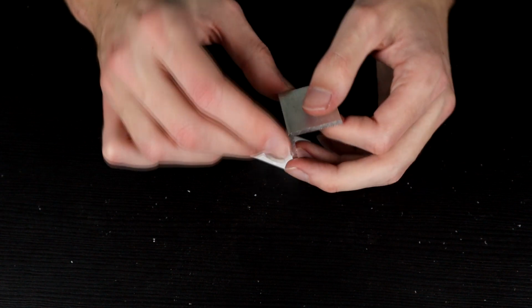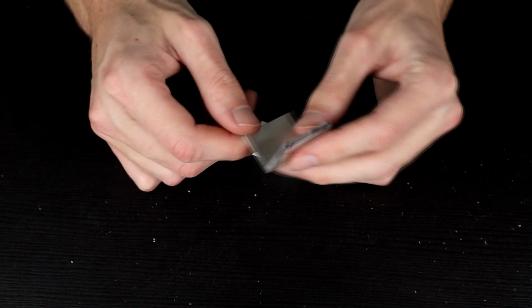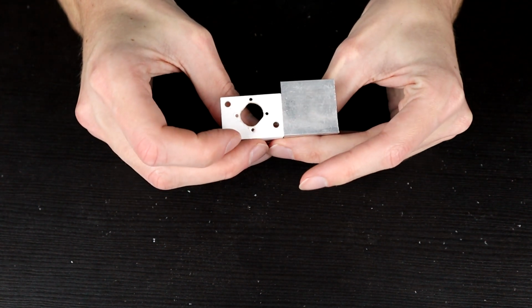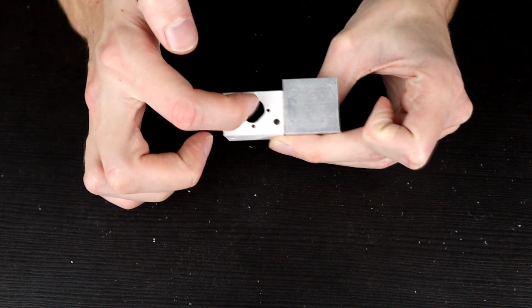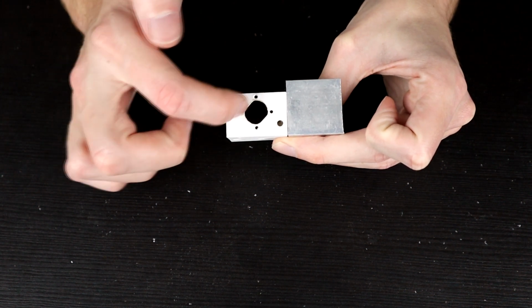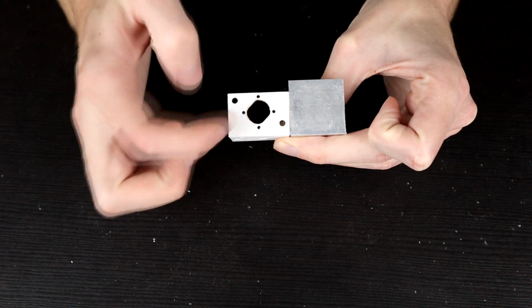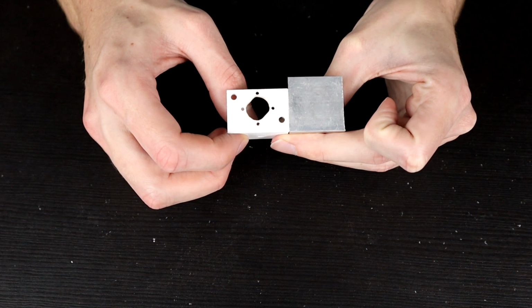So what I'm gonna try and do is, I've got this basically leftover extra piece here, and I really just want to try and rough a flat like that in. I can get a 12 mil hole in here really easily because it's 12 mil gap between the two flats. And then it should just be a case of sanding out, or hand filing out, an extra half mil in each direction on the 45. Although I have literally no idea how well this is gonna go.